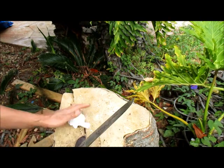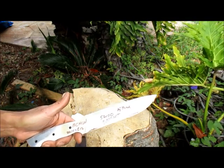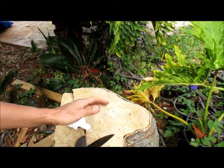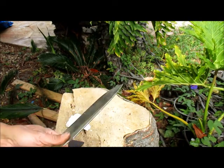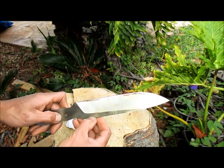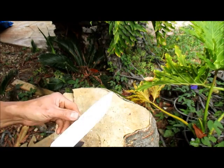Well, thanks for watching and please comment. Oh, forgot to mention what the hardness of this blade is. If you pass a lot of the tests, it has to be really hard. And so obviously this is above 62 because it withstood a lot of serious impact on a very thin edge. So anyway, the Rockwell of this blade is, where's the dimple, right there, and I got some more in here, and I think I ground some off. It's 64.5, so it would be harder than most Japanese chef knives.